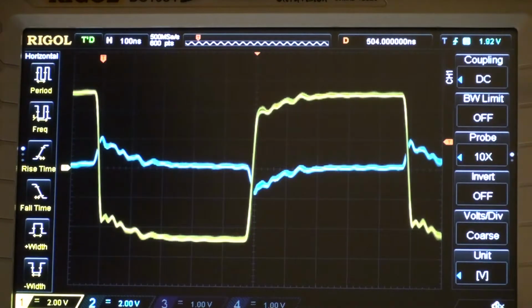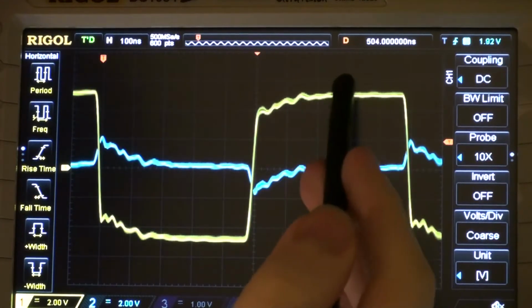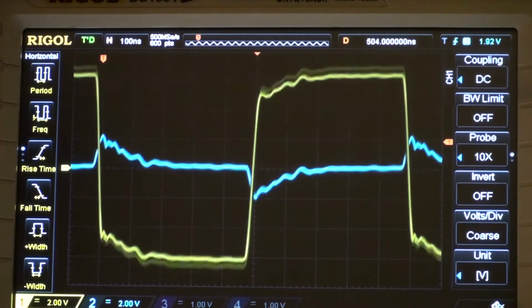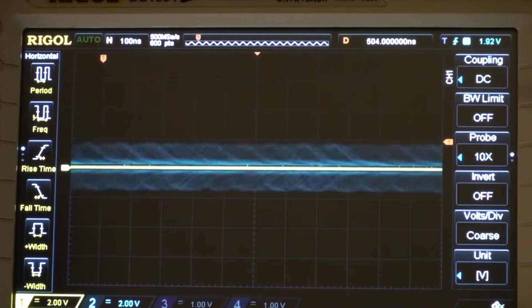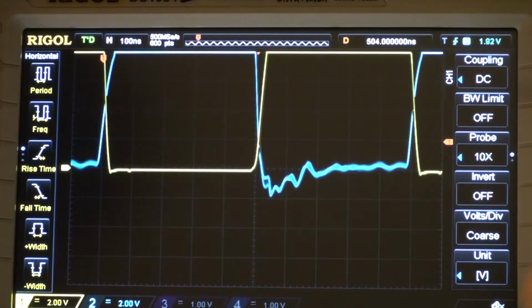we can measure how many volts this is outputting. So it's about 2.5 down here, about 2.5 down up there, so it's about 5 volts, which is not really what this device is saying that it should output. It states that it outputs 10 volts at current, so that's not really what we're asking for. So we can go into this parameter and increase it a little. Maybe that can give us better results. Let's measure again. See if it's just a current issue.